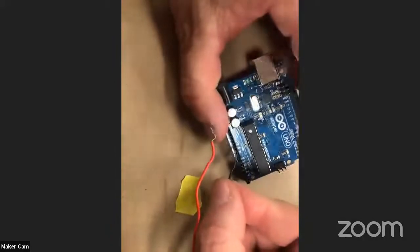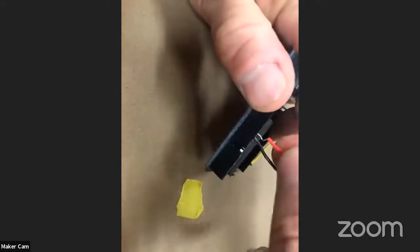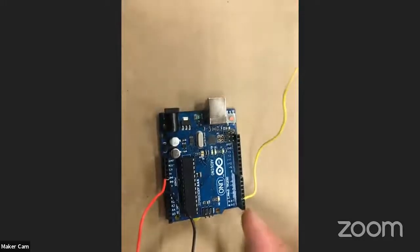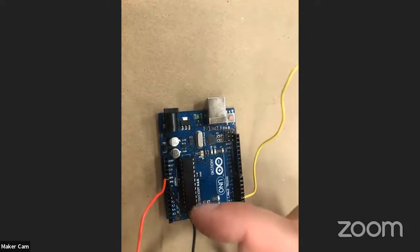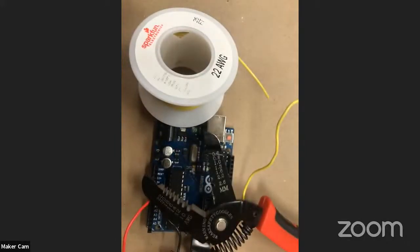There are two grounds down here. Stick it in — you want to make quick and dirty connections. You've got signal coming out of pin number two for the code we're using, power, and ground. Three connections done with solid-core wire and wire strippers — rough, quick, stick it in and move on. If you want to get fancy later and solder and have a better-looking enclosure, you can check Thingiverse for a pretty nice NeoPixel ring enclosure that 3D prints and snaps down into place.